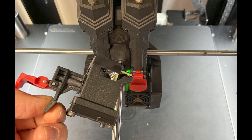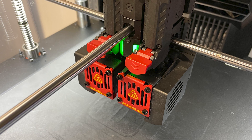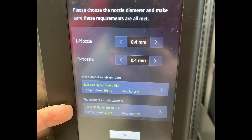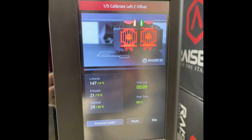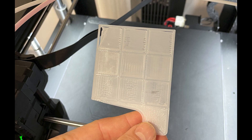Just wait until the screen says that the calibration was successful. Next, replace the calibration component with a hyperspeed hotend and also replace the right old hotend as well. Now it is time to calibrate the nozzle offsets in a way that is very similar to what you may already be used to from your Pro 3. To do that, load the hyperspeed filaments that were included in the upgrade kit. The screen will guide you through the calibration procedure. The only step that differs from the old procedure is the Z offset calibration, which now uses a printed pattern where you have to look at gaps in this pattern rather than the twisted lines that we had before.